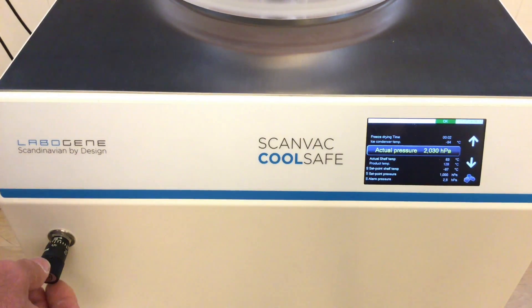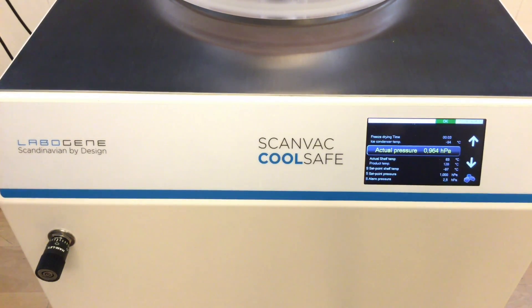Pressure continues going down. We will start to adjust the needle valve. Soon when the pressure reaches around 1, you can hear a small click — that is when the solenoid valve inside the machinery is open and injection of nitrogen air into the freeze dryer. Now the click, and that means the valve is open and injection — you can see the pressure increase, but it's actually increasing very much. This is an indication that the needle valve is too much open, so we will close it and make some adjustments to get the regulation more precise.